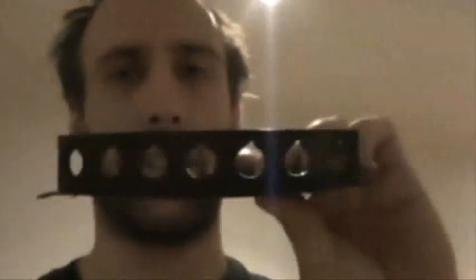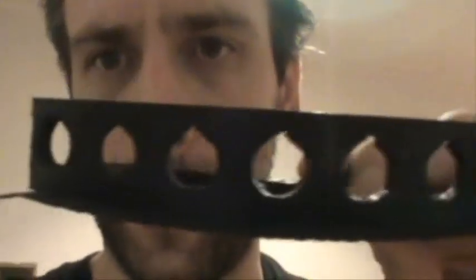Anyway, one of the problems with the sucker fan is it sucks air through and keeps everything cool in there, which is not preferable, because already there's no heated print bed in there, so when you're printing things, they warp. Sort of like, this one isn't too bad, but it's still unusable. See, it looks okay over here, but over here, see, it bent up, and when it does that, it starts mashing against the nozzle and making a bad job of the print. Anyway, this piece is totally garbage. Such a waste.